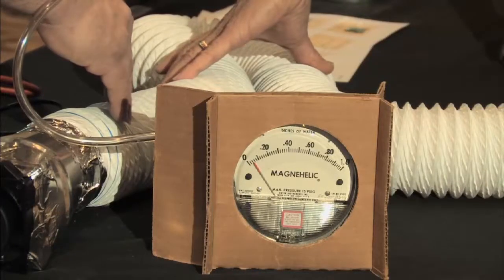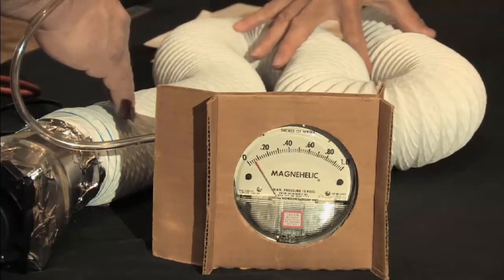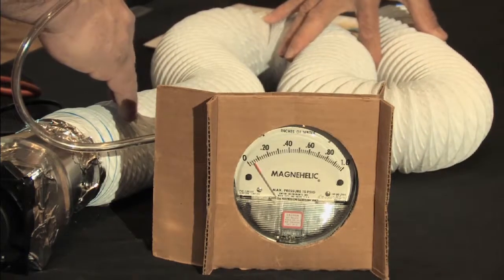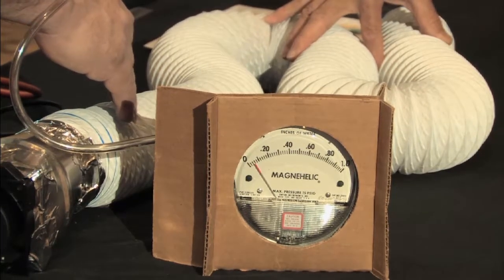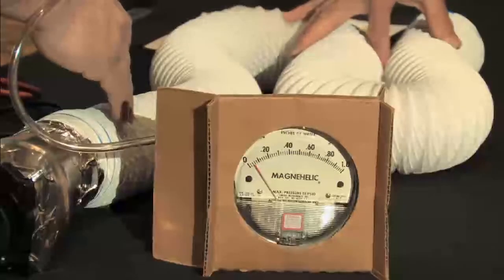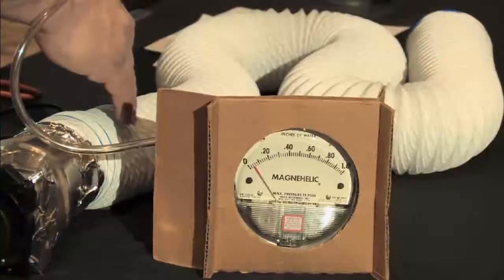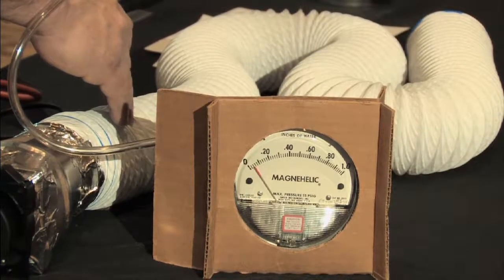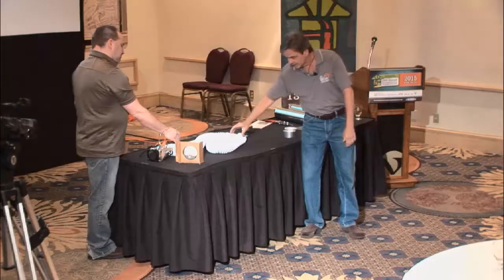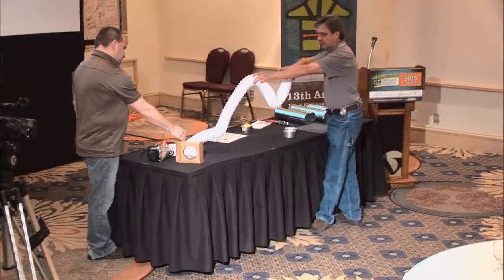And when you've got these relatively small fans in the bathroom, and they're trying to draw out, and you've got this snake running up like that, now you add to that, that in the attic, you get a little bit of this stuff going on, right? So you get dips and up and down. The bottom of the dip fills up with water, with condensation. It grows mold. And although it's blowing out of the house, so it doesn't bother anybody, it grows a garden down there. You could harvest it and put it in your salad if you wanted to, you know, it's good mushrooms. But it blocks the airflow.